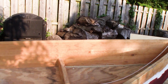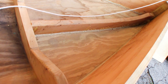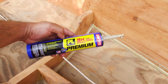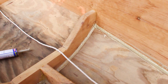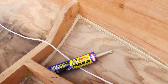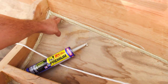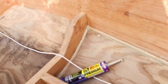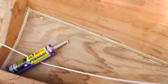I thought I'd show you something I did off camera. You can see these fillets that I did here — you can see them easier on this side. Nobody's going to see that. What that material is is PL Premium. If you go on all the boat forums they'll tell you never use this stuff. But if you are building a stitch-and-glue boat where you absolutely need the strength of epoxy, then yeah, I wouldn't use that. But this boat is plenty strong, and it is pretty hard stuff — not as hard as epoxy, but it's got just a little bit of flexibility, which I like.